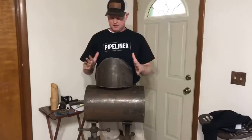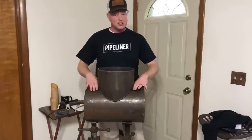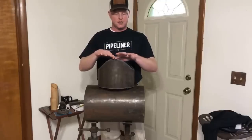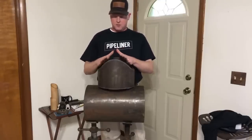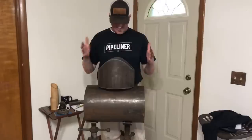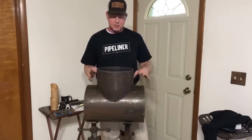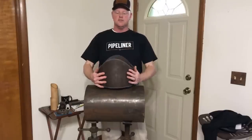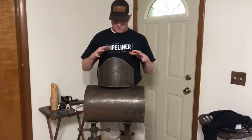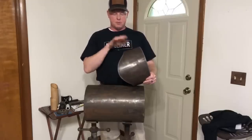Getting a good fit is key. Once you have it fitting well, bevel it — lay your throats back quite a bit, and lay your ears back a little bit, but not nearly as much as the throat. Check your fit after beveling, touch it up if needed. Leave a landing on the branch piece but not on the run pipe. Once everything fits perfectly, you're ready to mark the piece and move on.